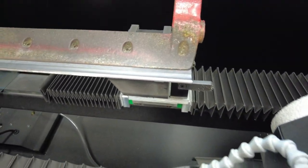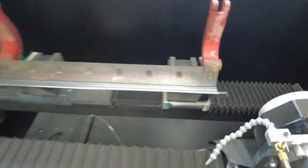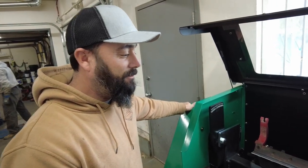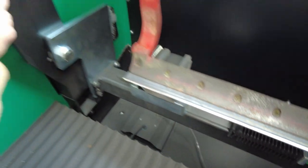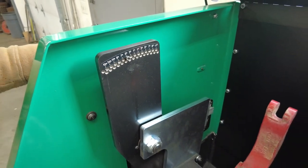You're going to swing down these little work stops, get them out of the way, and we're essentially ready to grind. We'll do the top face first. Okay, we're going to do the top face — that's right here, the top. We're going to set it at five degrees front relief and a five degree rear relief.